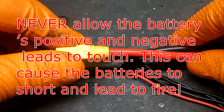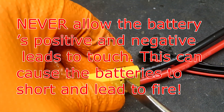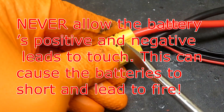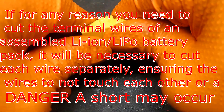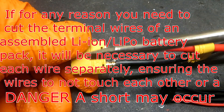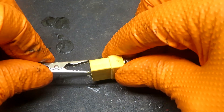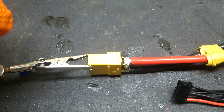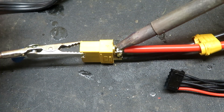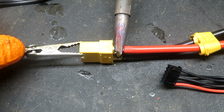Got the lipo here. As I said before, it has the XT90 connector on it. We're going to desolder instead of just cutting the wire. Just want to be careful doing this because you don't want to short the terminal — that way we can reuse it. If you short it, all the power from the battery will just dump out and weld whatever shorts the circuit between positive and negative. You don't want whatever lead you removed to come undone and short on the other side to connect the pad. Go ahead and desolder the positive off very carefully.